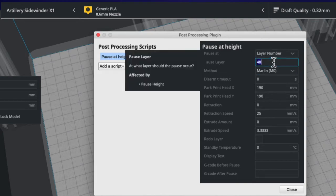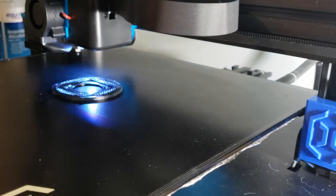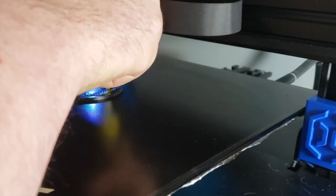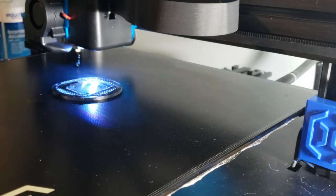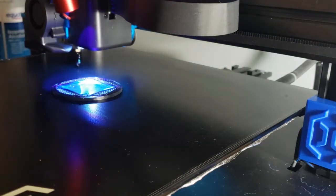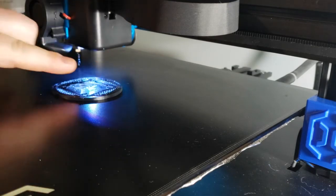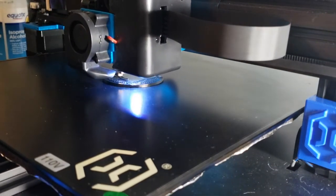The way I did this is I set up the 3D printer to pause after a certain layer. During the pause, I put glue in the corners of the square where the plastic lens would be attached. In this case, I used UV curable glue, so that it would be easier to work with and I wasn't rushed before the glue dried. I think super glue would work too, and it's a lot cheaper. Once the lens is glued in place, I sprayed the lens itself with hairspray and continued the print. The hairspray acts as an adhesive to allow the hot plastic to stick to it and seal it properly.